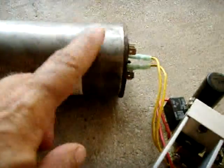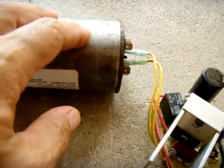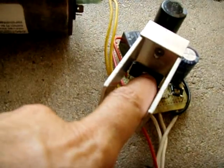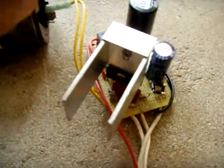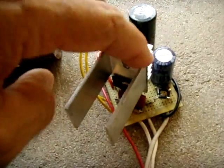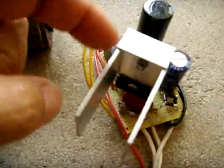When you unplug this, the bleed resistor causes the capacitor to discharge at a decent rate to eliminate the high voltage. The other side of the capacitor flows into the rectifier — in this case a 10 amp rectifier. I made a heat sink to dissipate the heat, as this is the only part of the circuit that gets hot. Make sure there's a suitable heat sink; too small and you'll fry your rectifier.